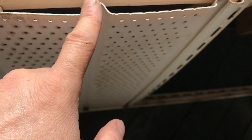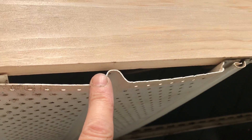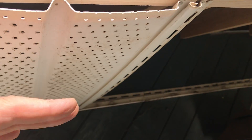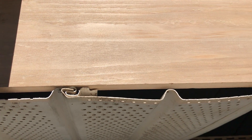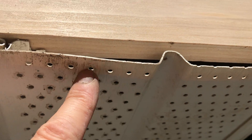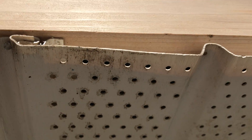This was about 30 years ago, but what I ended up having to do was nail this one first, leaving a little gap, then coming up and nailing this side. If I nailed here and there and just kept going along, I tended to make this side longer. So keep that in mind when putting soffit up — you'll know right away because your cuts won't be even with the holes and you'll end up with an angle.